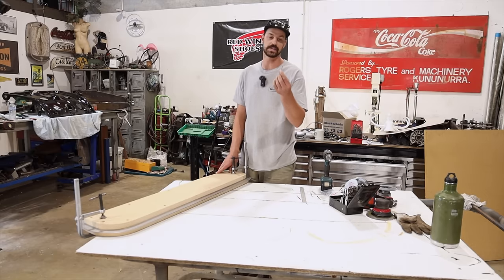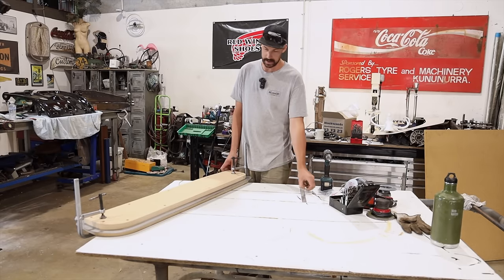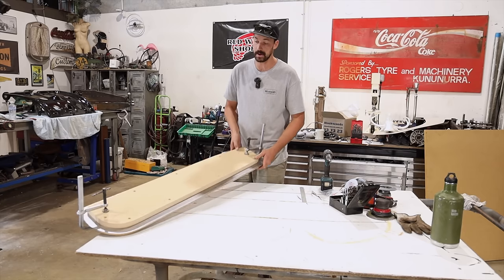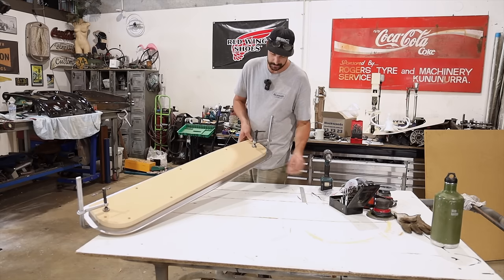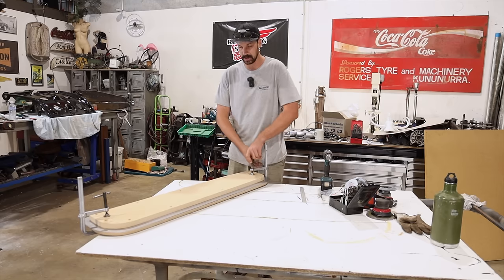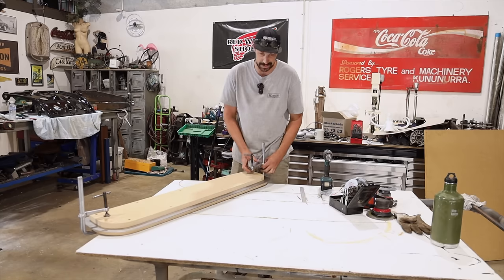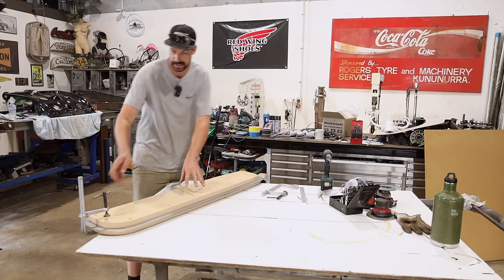Some stainless countersunk 316s by 2.5-inch bolts, and they're going to work to hold everything together. So I ended up using about 10, and then I just ran a bigger bit through so that these will sit sort of flush mount or even inside a little bit. I did it on both pieces of steel, so now when I remove everything, everything should go back the exact same way. So we should have a perfect match for each side.